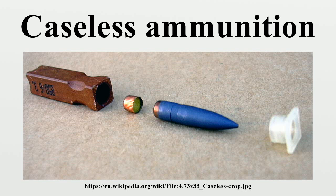Another important function provided by the cartridge is to seal the rear of the chamber. During firing of a cased cartridge, the pressure in the chamber expands the metallic case which obturates the chamber. This prevents gas from exiting the rear of the chamber, and it has also been experimentally shown to provide a significant amount of support to the bolt. Without the case to provide this seal, the firearm design must account for this and provide a means of sealing the rear of the chamber.